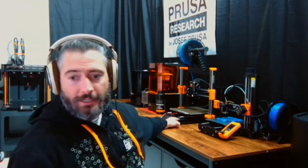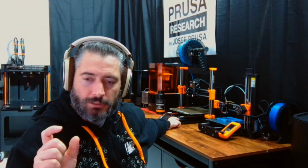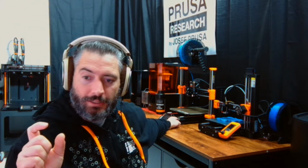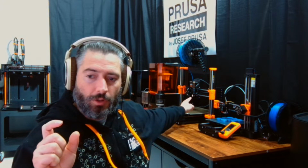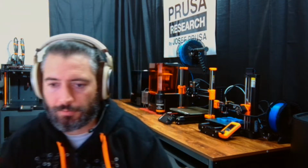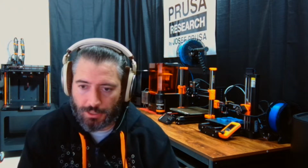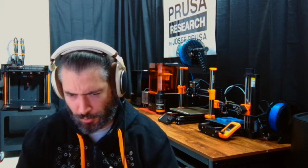So when you're tightening, I'm gonna have to look at it, do this. When you're tightening these screws here, you can get just a little bit of play, and so there's like a tolerance stacking. So if I tighten this side a little bit off, and then the other corner across from it is also off in the same direction, I might get something that's askew, and that's just something you need to pay close attention to. It's in the instructions. And you can loosen them all, press it down on a flat surface, and then retighten it, and it's perfectly fine. But it's all within tolerance of the sensor, the Pinda sensor, or Super Pinda now.